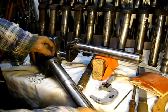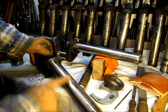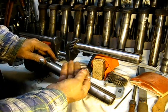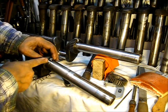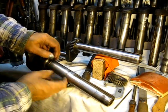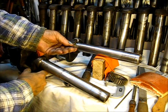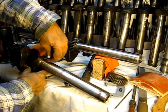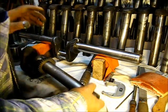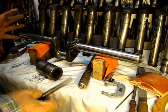A sidebar: if you disassemble the crankshaft and take the timing gear off — which is what I did on this one — it will have a round hole in the crankshaft with a flat keyway. It's a T-shaped key that goes right in there. You can't go wrong because it matches up right there, so you just put that on and you're good to go.